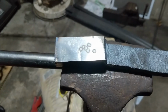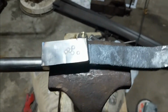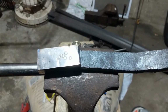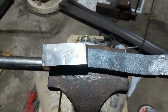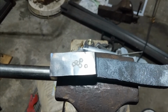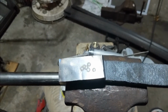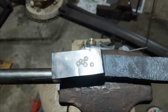What that instrument does is it uses a tungsten electrode up against the surface of the steel. It induces a high energy spark, and the resulting atomic emission from that is representative of the elemental composition of the steel. If you grab a drinking glass of water, put a whole bunch of table salt in there, mix it up thoroughly, and then put a little bit of that saltwater solution over an open flame, like your kitchen stove top, you will see a bright yellowish orangish flame come off.